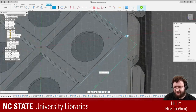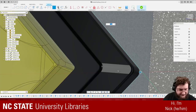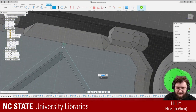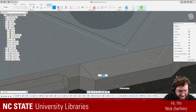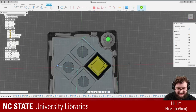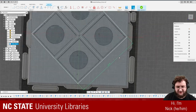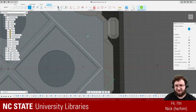I'm going to double check by bringing in the button. Zooming right down on this, you can see the sketch chamfer we're creating — it looks like it's actually closer to 0.75. So 0.75 is what we want. I hit enter on that and — yeah, that's what I thought would happen. The problem with sketch chamfers is that they tend to break relationships. So rather than doing it the typical way, I'm actually going to manually add the sketch chamfers.